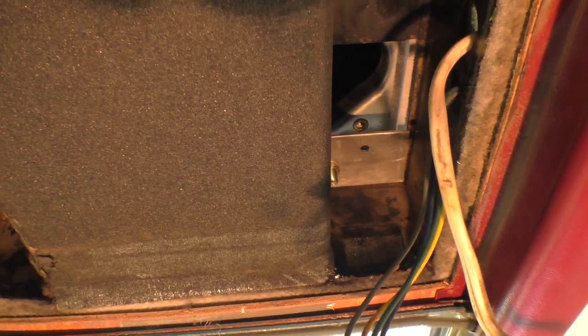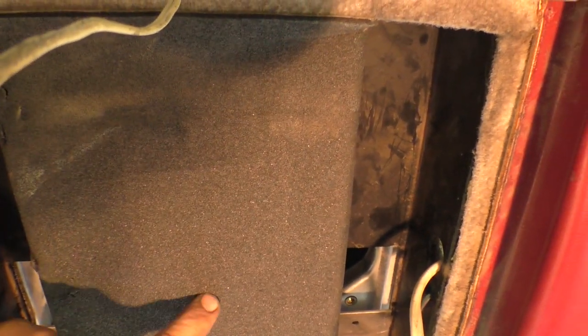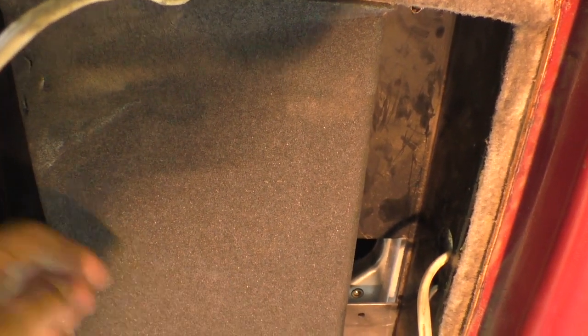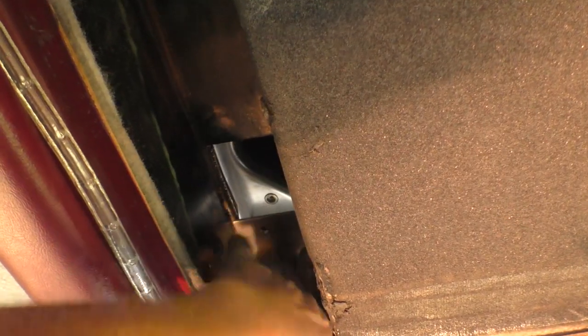Okay, so this is what it looks like from the inside. And here's the plate that I made. There's the hole we're going to go through, and the bolt hole that it's got to go to in the air conditioner on both sides. So they line up. We have test fitted this thing. This is the duct that runs down the center of the bus and meets up with the hole that's in the center, and I can feel that the gasket is compressed. I can see this gasket here.